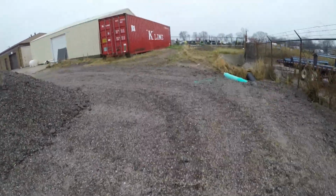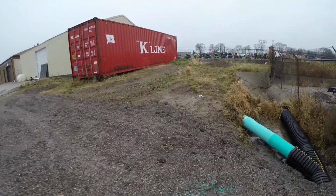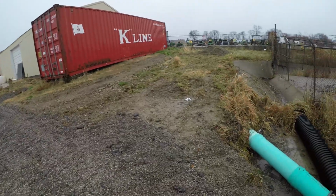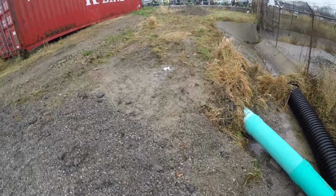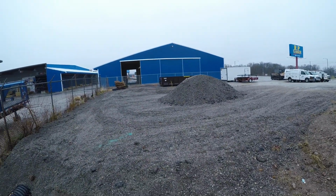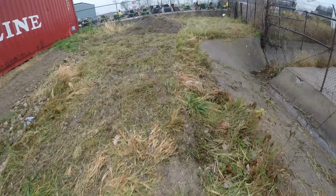We're gonna get a couple more loads of rock in here, probably 3 or 4 more tandem loads, and gravel all the way back there, up along the building, just really clean everything up nice. So get everything drained into where it needs to. Some of this area over here is going to come into this culvert on this end, and everything else on the backside over there is going to drain to that T, can act as a surface drain. So should be really nice when it's done.